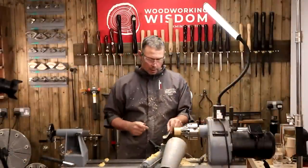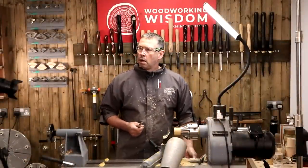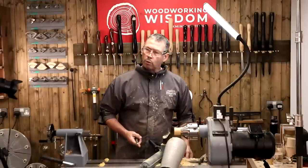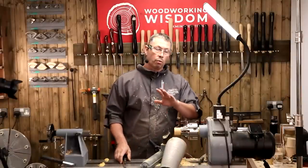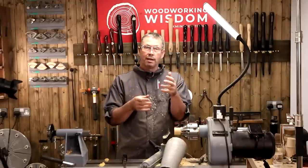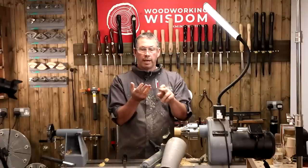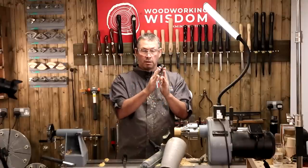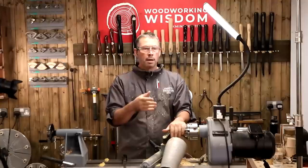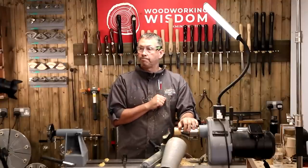And then Mark has cut some sycamore this morning into boards. Is it best to lay them flat or stand them up to dry? So if you want to keep them white, stand them up. That's what the old trick was in the timber yards, to keep things white and stop the water settling. Then stand them up. Any white timbers, so sycamore, hollies, maples, those sorts of things, stand them up. If you're not worried, if you're going to cover them and they're in a barn, then you can stick them inside and have them lying horizontally.